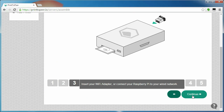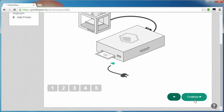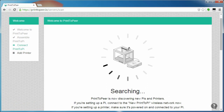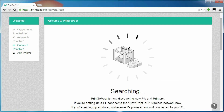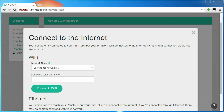For using wired LAN, aka ethernet, it is extremely simple to set up. Transfer the image to your SD card, plug everything in, click through the wizard on Print-to-Peer's site, and your browser will then automatically detect and configure your Raspberry Pi with the Print-to-Peer client. You can also use Wi-Fi — Print-to-Peer will set up an access point on your Raspberry Pi, which you can connect to with your computer and then tell the Raspberry Pi which wireless network it should use. And that's a really smart way of handling things.